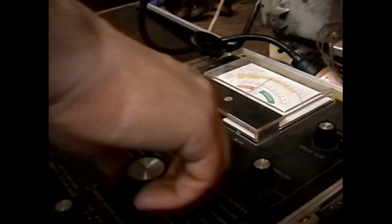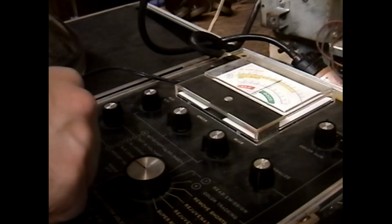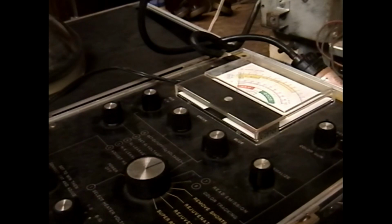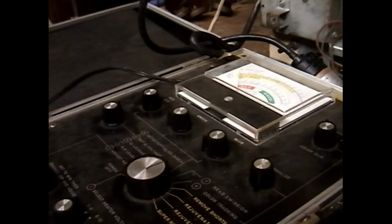Let's just increase the heater voltage on this tube to about 7.5 volts. And leave it in test emission mode for a while and see what happens. We're going to find out if the picture tube in this Admiral's any good. I'm just gonna leave it on Dean Martin roast mode and...